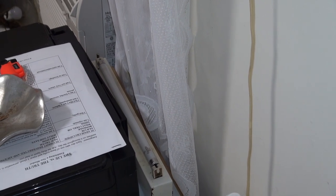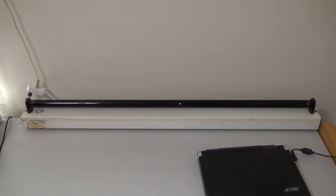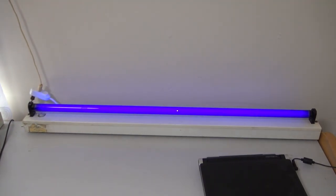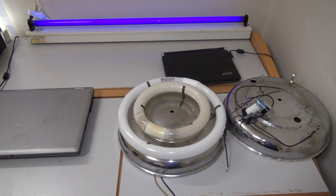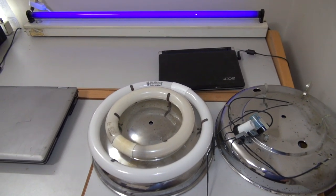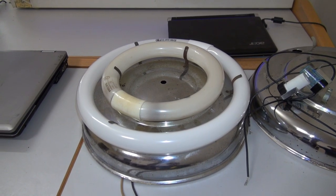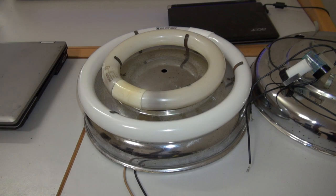We also have another light from the diesel nut - F8T5. Right next to it is the light fixture from Jimster 586 with a blacklight bulb in it - pretty cool. Right here is probably the only rapid-start fluorescent fixture I own. I got these two off eBay, and this one is being converted to preheat while this one is going to stay on its rapid-start ballast. Let's watch a couple startups of this rapid-start light - interesting but not epic.